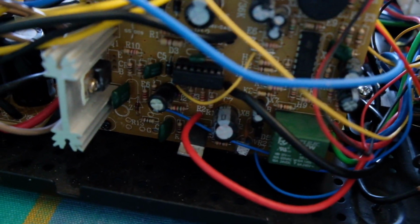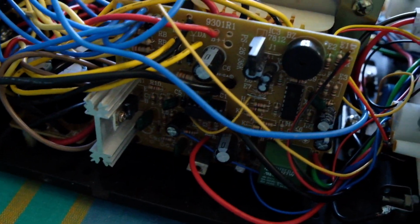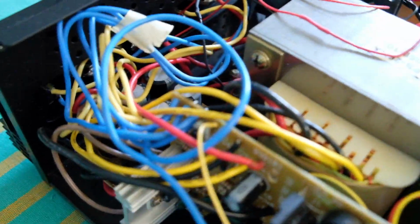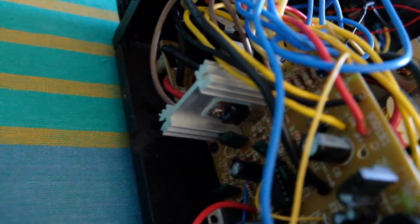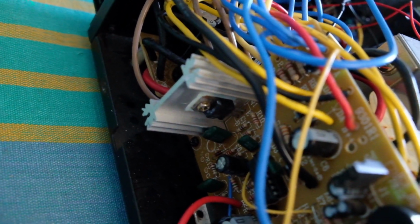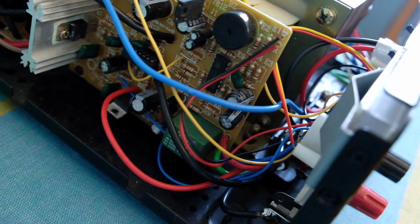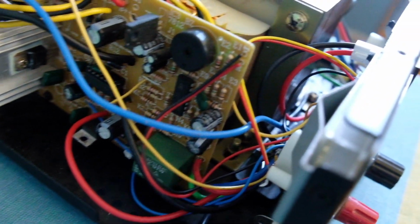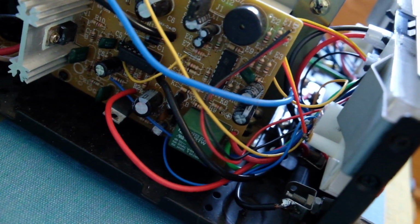The main board is actually over here. You can see there's one control LDO, a linear regulator, and that's the brains of this whole thing, and that drives the base driving of these 4 transistors, and there's another heatsink that's, I think, driving those output transistors, which is also one of the transistors that blew up. So among the things that failed was that controller IC, and the SCR, the triac, which was on the output to prevent the over voltage, also had blown up, which has a Zener diode based control circuit.